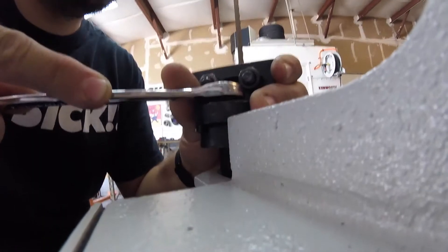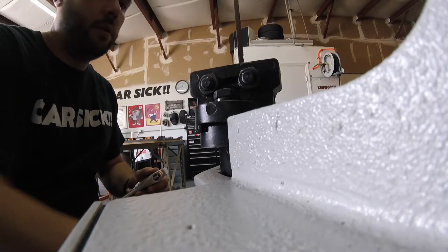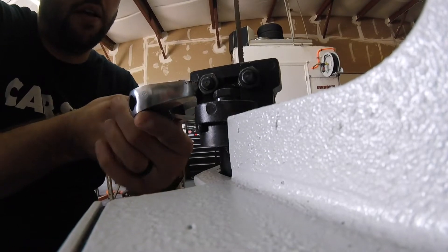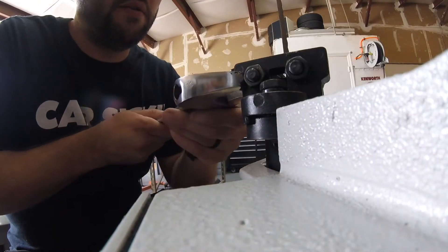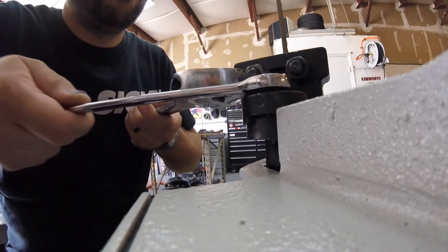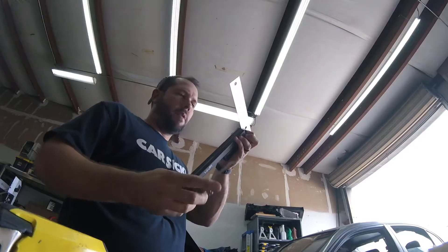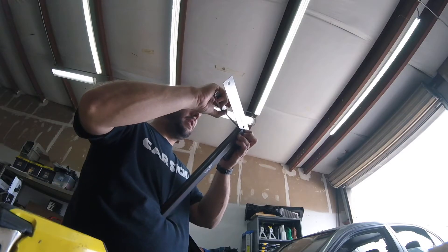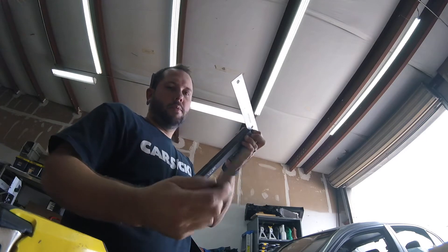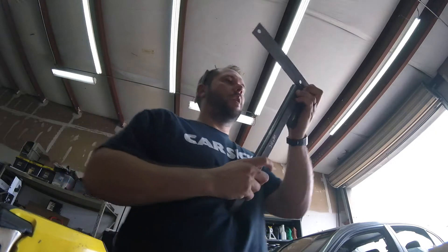If I take this guy and twist it ever so slightly — I don't really like this adjustment, it's hard to get super precise. If I put my adjustable wrench on it I can move it just a little bit. I grabbed my feeler gauge and still see a little gap — nine thousandths of an inch. I think that's pretty good; I don't know how much better I'll be able to get it than that.